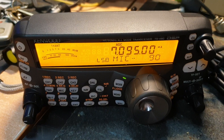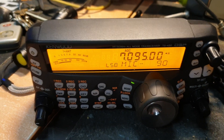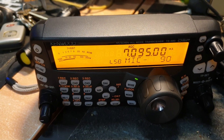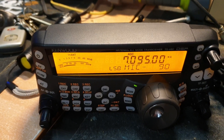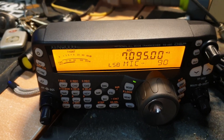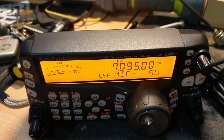You should see the 480 HX — that makes that meter go off the side — getting a good 200-plus watts, around 220–225 without even getting warm, so they're amazing. A little hint: you can bring the 480s up in power, but just remember you're limiting the antenna tuner's ability to do its job. People talking about getting 175 watts out of a 480 — keep them around 100 to 110 watts and they'll last forever. 73s, VK3 Charlie and Mike, cheers.